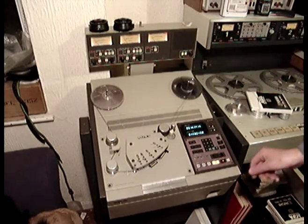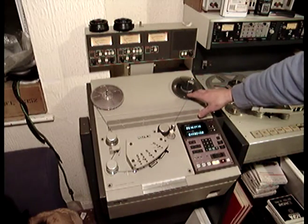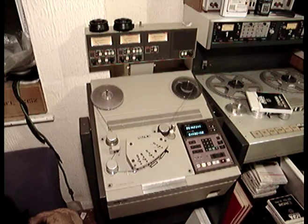The way Granada do, and the way the BBC sometimes did, was to store the tape wound onto the take-up reel. So when stored away, the tape is not in a suitable position to be played straight away — you have to rewind it first. The reason for this was due to print-through. The myth about storing tape oxide-out is total dribble; it doesn't make any difference — the tape will still get print-through.